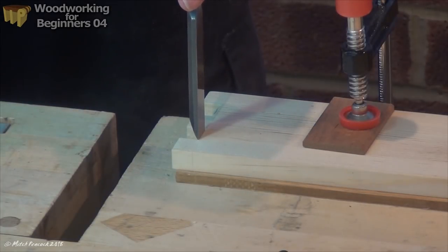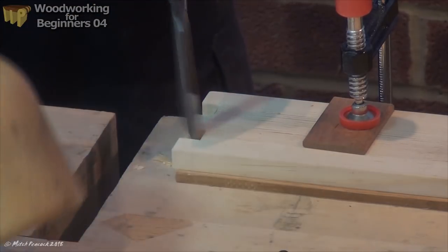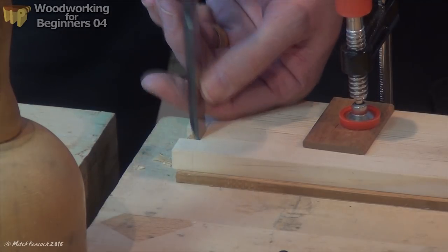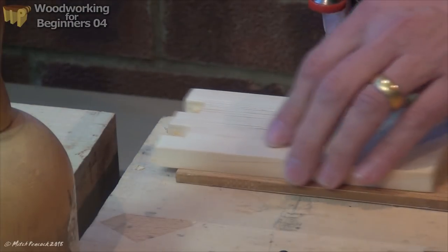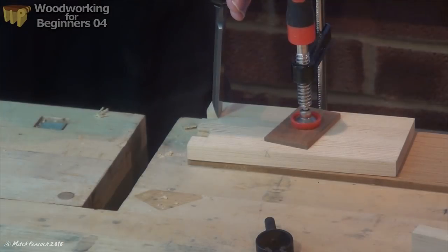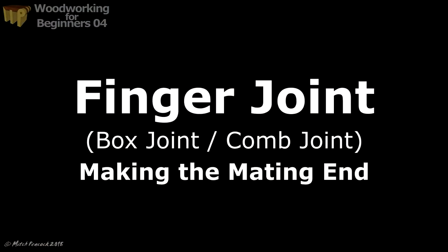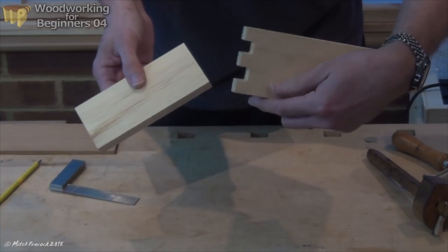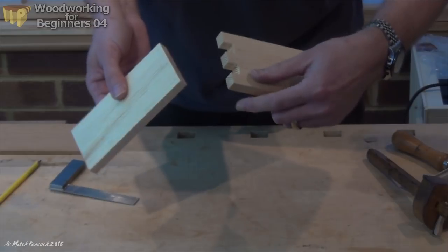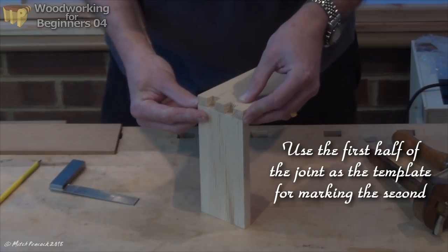Now before I make a terrible mistake, I'll mark in which pieces we need to remove. I can either use a fret saw or a jeweler's saw to cut out the waste. With a chisel slightly narrower than the waste, I'll chop and gradually approach my knife line — finally resting the chisel in the knife line and chopping for the final time, before paring away the corners the chisel didn't quite reach. So far I've chopped halfway from one side; now I'll flip it over and complete it on the other side.